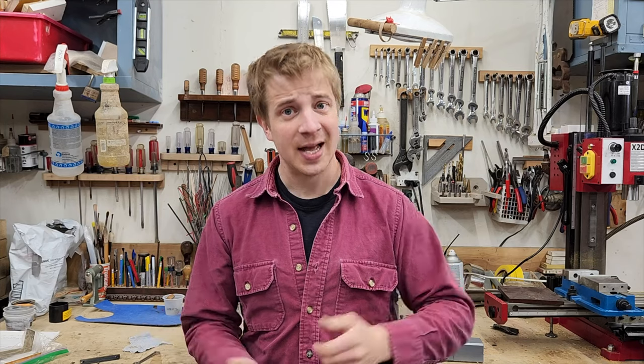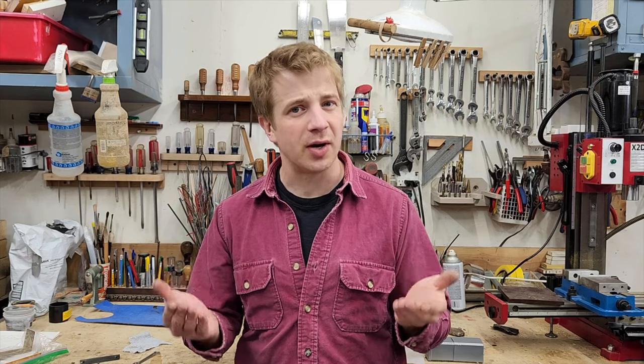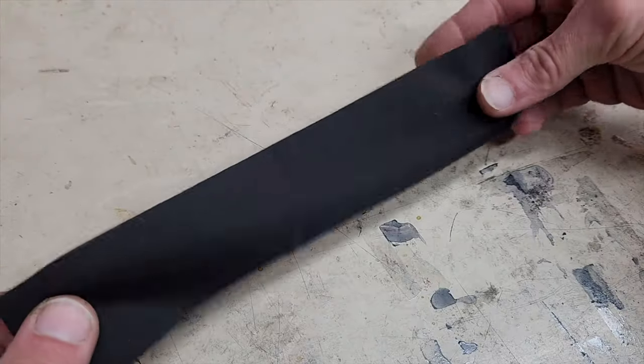Now, originally these pneumatics were covered in a rubberized cloth, but after nearly 100 years, the rubber has failed, dried out, and now the cloth is leakier than a bedsheet. Unfortunately, as far as I know, we can't get any good quality traditional rubberized cloth like they used back then. So I'll be using a synthetic cloth, which is extremely airtight.